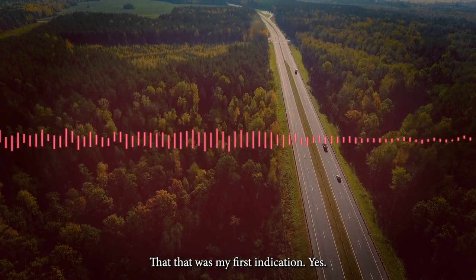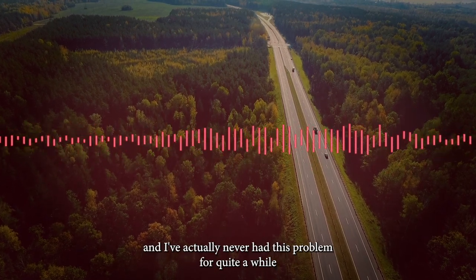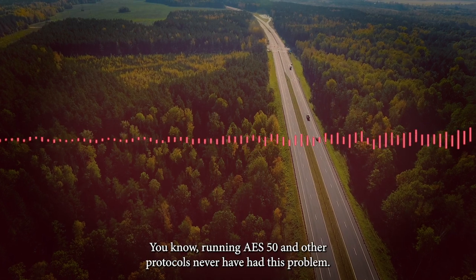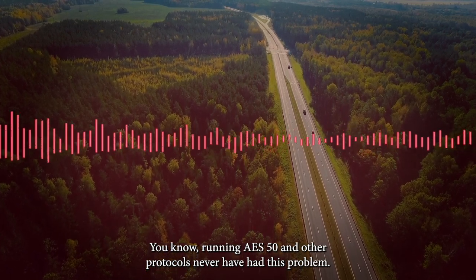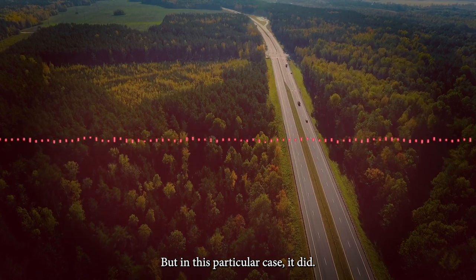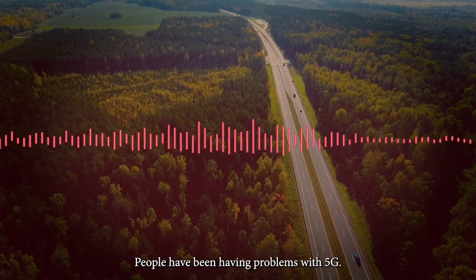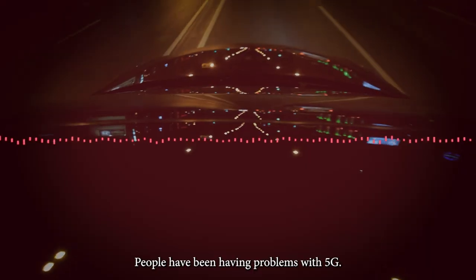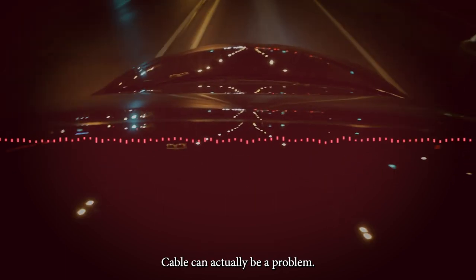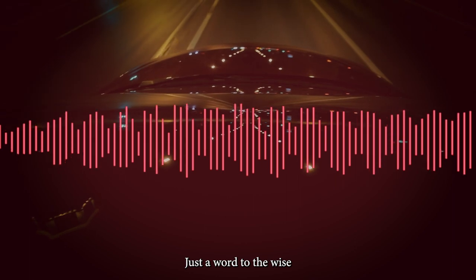That was my first indication it was actually the power cable. I've never had this problem for quite a while ever since digital stuff came out — running AES50 and other protocols, never had this problem — but in this particular case I did. So something you can try if you run into this: it was AM radio, but people have been having problems with 5G and all kinds of things. Your vertical runs of power cable can actually be a problem — just a word to the wise.